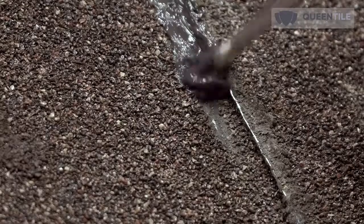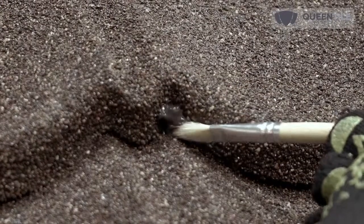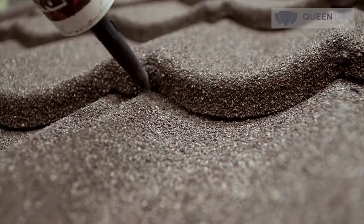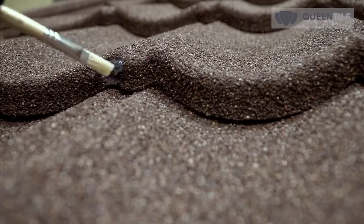The binder is applied by drops, so that it completely covers the place of damage or fastening points and securely captures the granulate. Important note: the glaze should be applied only the next day after treatment with the binder and granulate.